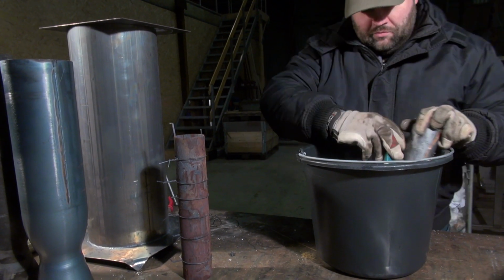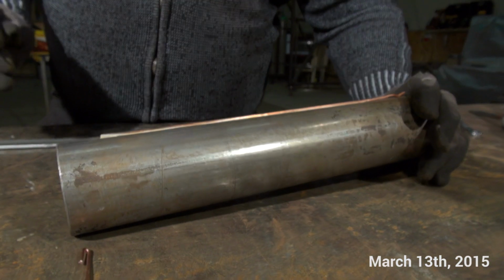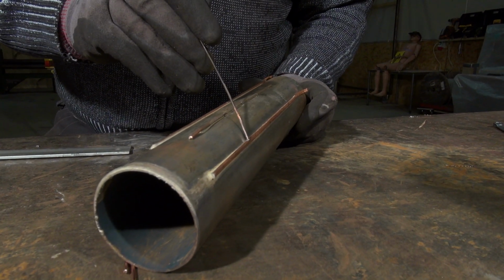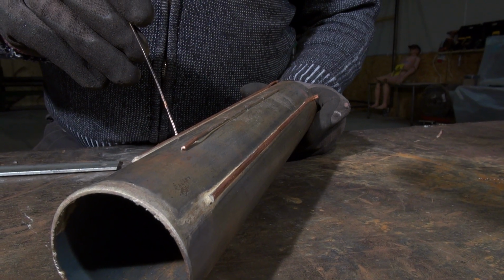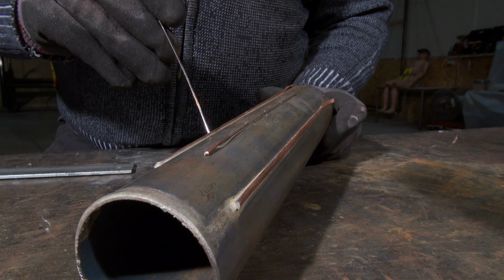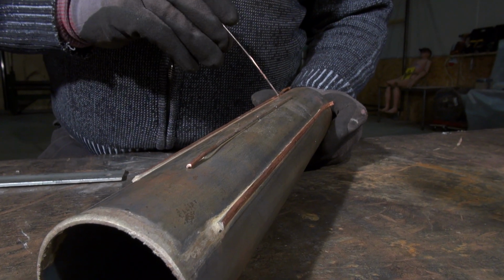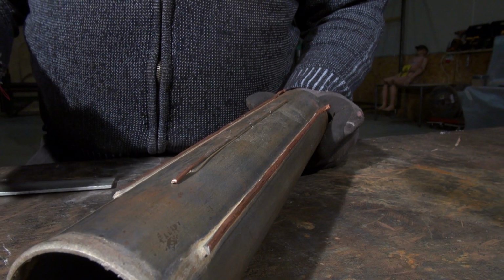Okay, I just want to show you the latest results from our most recent soldering test. This is again one of our test tubes, just an iron tube. Now we have three things soldered onto this tube. These two here and here are these 3 millimeter diameter copper tubes I mentioned that we ground 1/3 of the way through, so it became like 2 millimeters high. It also left an inside cavity which fitted very well with a stick of this silver solder material.